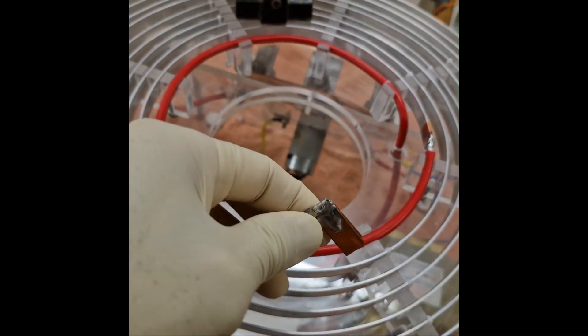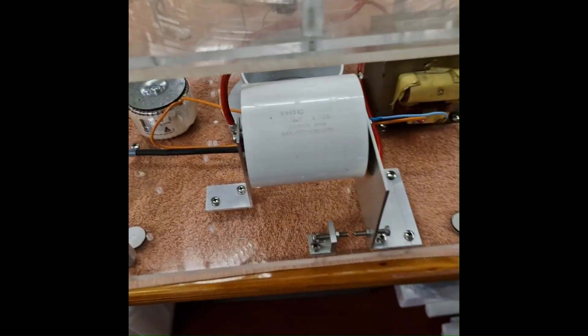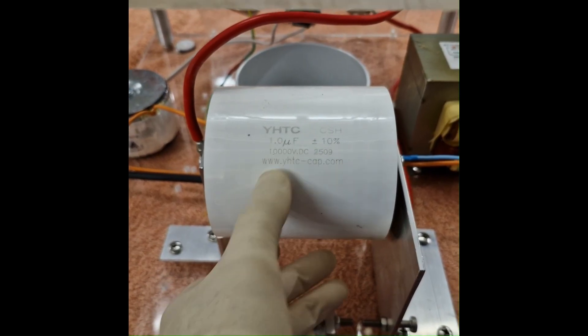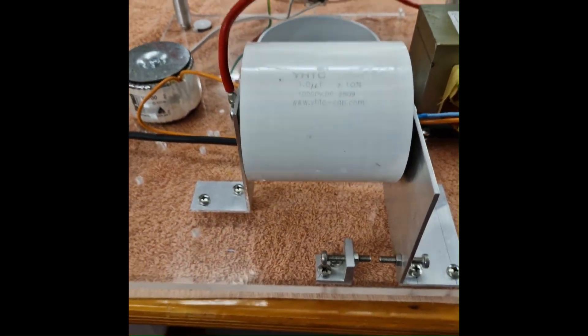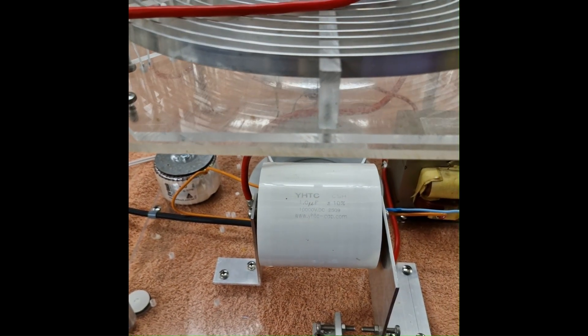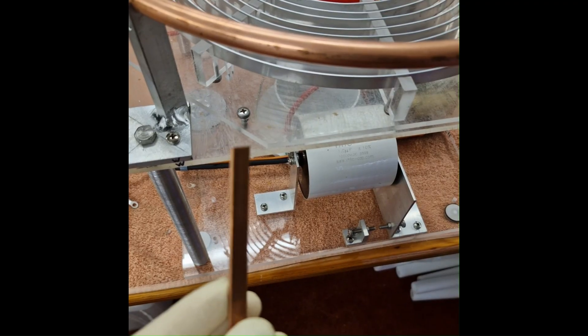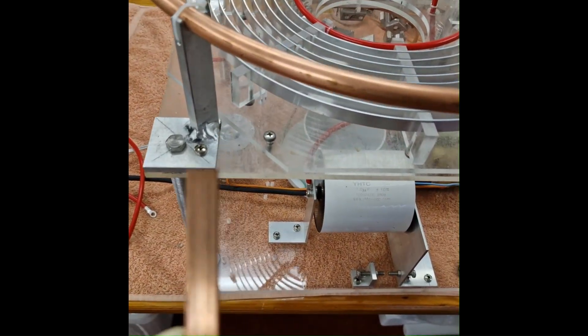The tuning clip is right here. Being a flat bar, you want something to make really good contact. Very simple, made of copper. You can use an alligator clip, but with an alligator clip the teeth make very minimal contact and it does get hot and overheat, particularly when running something big like this one microfarad capacitor. This is probably way over the usable capacitance, but it was available so I thought I'd get the maximum capacitance I could. So let's see how we make that clip very quickly. This is copper flat bar, 1.5mm thick - any thicker and it's too hard to work with, any thinner and it's too flexible. So 1.5mm thick by about 10mm wide. I'm going to cut a small strip of that.